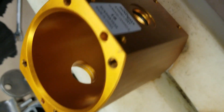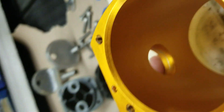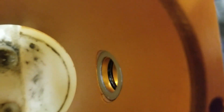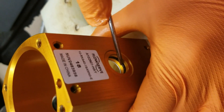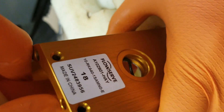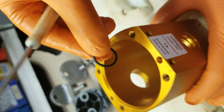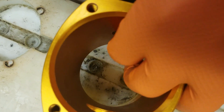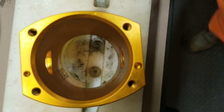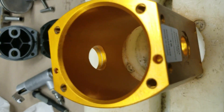There is a seal and washer in the body. On the top portion of the body, there's a black O-ring inside the top of the pinion, and there's also a washer on the inside — both of those will need to be removed. We'll take a pick or small screwdriver and go in and get this O-ring out of the body. Once the O-ring is out, do the same thing with the washer — nudge it a little and get it out of the body. Now we've removed the washer and O-ring. The body is clean and all the perishable parts are removed from it.